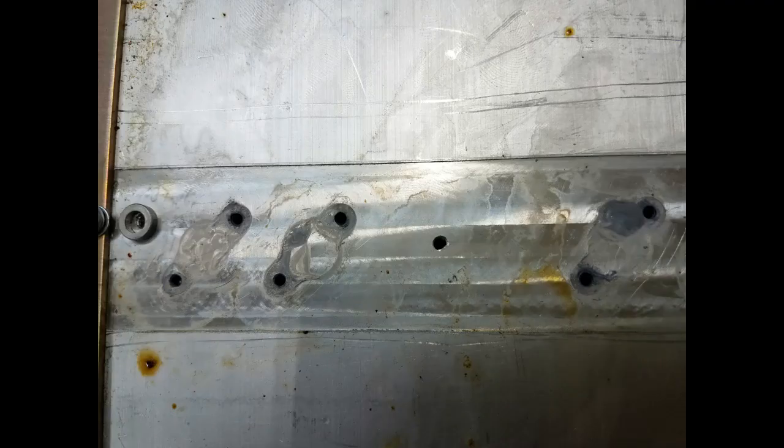These problems aren't new. This is a very early ALS-1300 that came in for service, and it had been worked on unsuccessfully a few times at the factory. When I pulled the circuit board to look at the heat sink machining and cleanliness, this is what I found — so we can see this is a long-term problem. It doesn't do any good to complain about it. We just have to fix it as best we can to get the FETs transferring heat into the heat sink and slow down the failure rate.